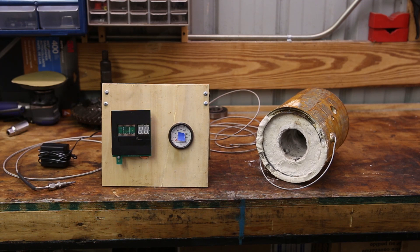A couple of things to note from the video: it's a little hard to see the digital display in daylight — that's mainly because of the way the camera sees the LED light. Simply putting a blue filter over it would have helped; it would have added contrast and allowed the camera to pick up the digits a lot better. The other thing I noticed after reviewing the footage is that while the setup was heating, the two gauges were way off. That most likely was due to uneven heat distribution inside the furnace.